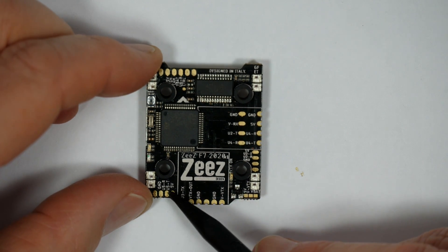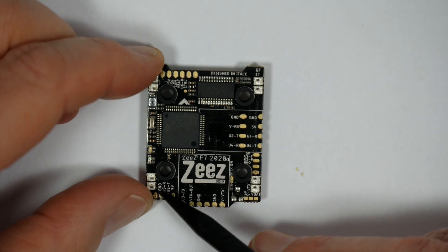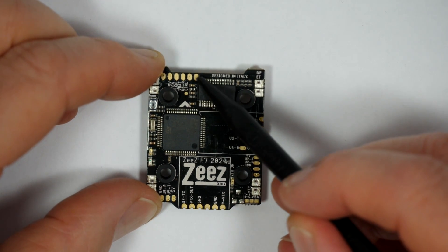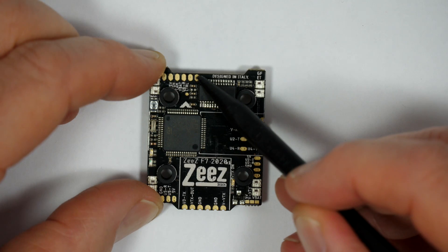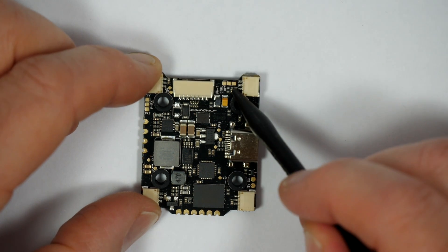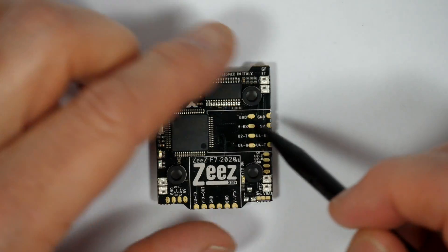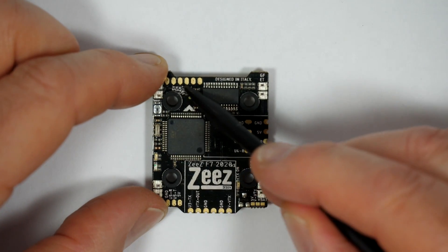Along the bottom here are the header pins for the connections to the VTX. Along here we've got UART5 I/O pins with a couple of 5V power pins, so you could easily use this for GPS or something. Along the top here you've got the connections for your FPV camera, and there's a control pin on the right, so you can use either joystick emulation or serial for camera control. There are a couple of solder pads on the back — these are the ones you bridge to choose whether you're going to use joystick emulation or serial control. These are the same as the ones on the 30x30 but they've had to put them on the other side of the board because there's less space. This is using UART6.